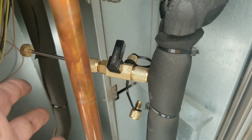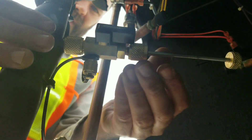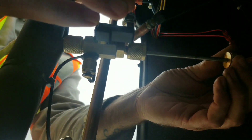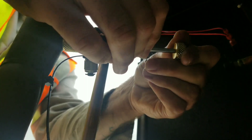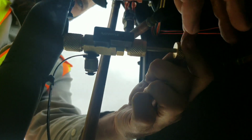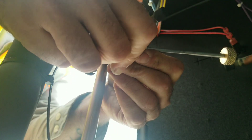Once the core is loose I'll show you that step. Everything is closed and tight, the ball valve is open. We're going to insert the rod down and try to find that Schrader. Once you find it you'll know because you can feel it grabbing. What I usually do is keep my fingertip here on the end and just start to rotate, because it's under pressure. Once that Schrader comes out you have to apply a little bit of pressure in the other direction. Once you feel like you've got the Schrader Core and it's popped out of place, let it slide back and close the ball valve.